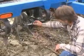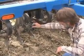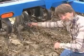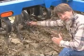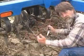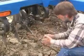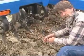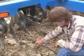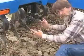The other important part of the tine that's very significant is the base of the tine, in that the tine blade itself is cast into the base at a five degree offset. So the tine, even though the roller may be straight, is not just making a clean slice. It's actually twisted and it goes through a rotation as it moves in and out of the soil profile, creating fracture forces regardless of the offset of the roller.